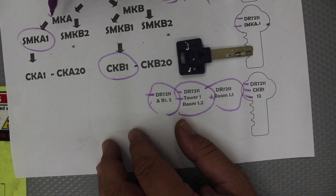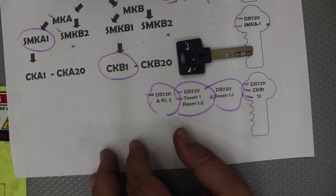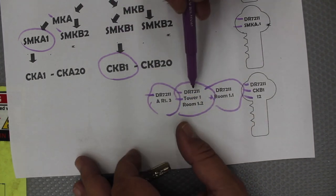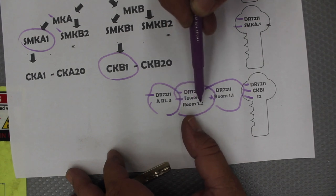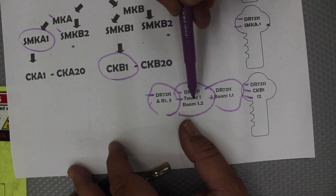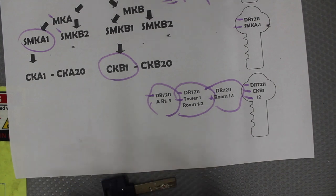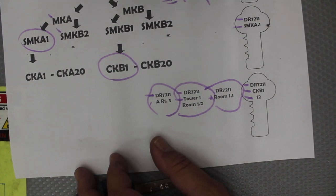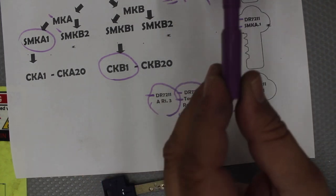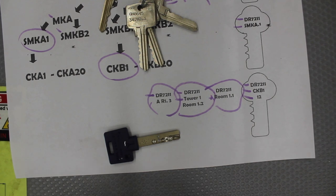A lot of people split their business into A and B, or even A, B, C, D — almost unlimited possibilities. On a small business you'll probably only have an A and a B. We avoid terminology like MK or GMK with clients as it confuses them, so we might say 'cleaner point one tower one' or for a school, 'classroom six point two' meaning the second key cut for classroom six. That's a brief explanation — any comments, leave them below. Thanks for watching.